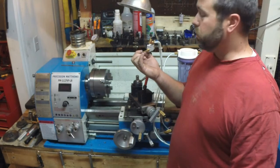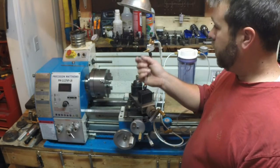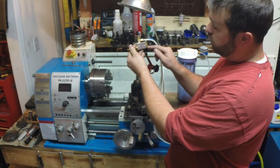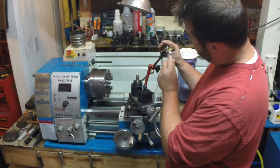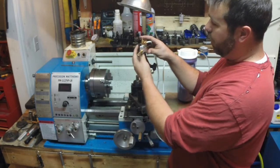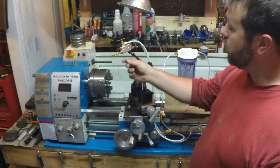The brass tip here is drilled all the way through with about a 100-thousandths diameter drill bit, and then the actual orifice at the tip is 45 thousandths. I was just scared to use the 40-thousandths drill — the smallest in my set — but I'd probably tighten it up to 40 if I did it again. The tip is threaded in from this end. These two holes are simply for mounting a threaded rod that the indicator holder base clamps to — purely functional, and the rounding is just decorative.